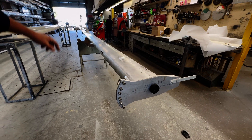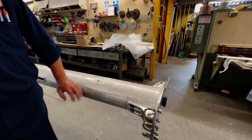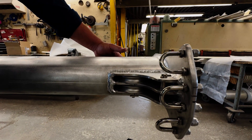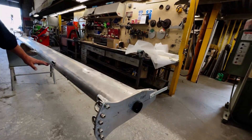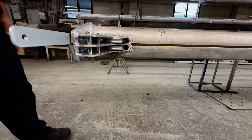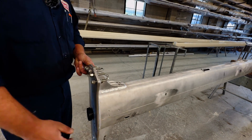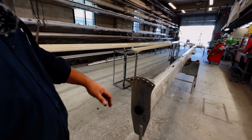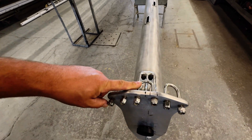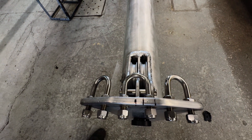We're creating a brand new mast using a K35 section. In this we have your standard Claco masthead, which gives you two forward sheaves as well as two aft sheaves and the ability to carry two spinnakers, all halyards working independent of each other. As an updated form of mast, we now refer to this as our updated head, which means that you have a third bail, which allows for a solent stay and/or an additional safety attachment should you need to go up the mast.